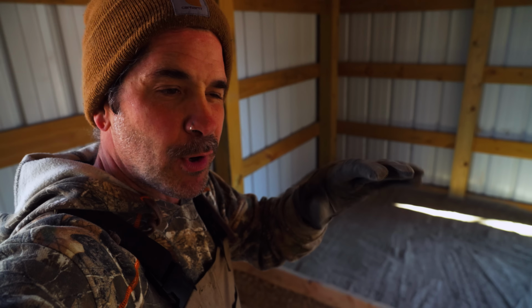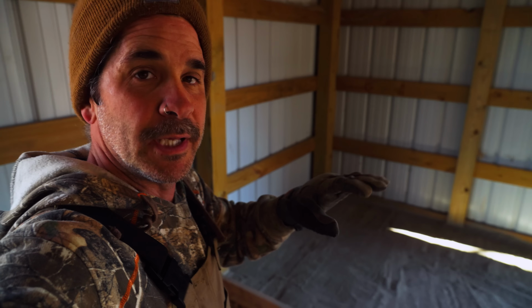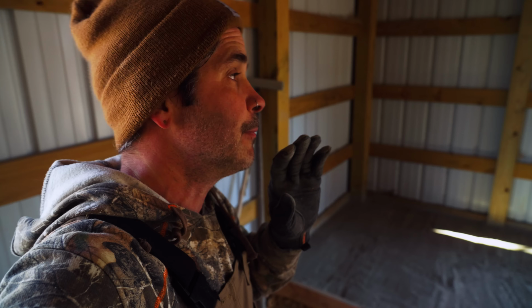All right, guys, I'm impressed, not too bad. I might try the new one on there as well. I just wanted to see before I go ahead and flatten it all out and really do my final product. That is the biggest thing of a dry pour: test and test, and if you don't like it, redo it. That's literally the best part of this, you're not in a rush until you put water on it.